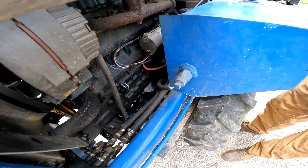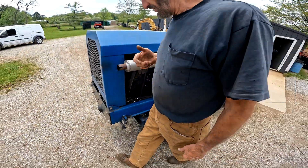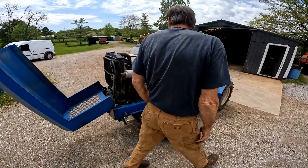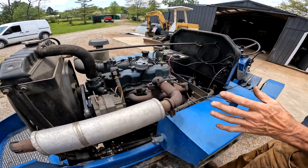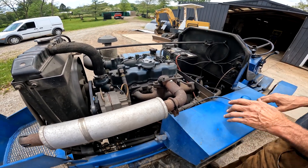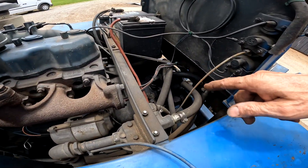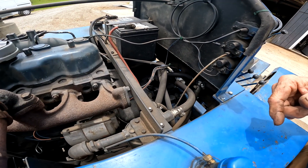What drives that is on the back of the engine — let me open the hood. This is a Kubota V1903, it's about 42 horsepower diesel. It was a power unit and I just took off everything I didn't need. It has a standard KT bell housing — a smaller bell housing — set up to bolt a hydraulic pump directly to it.